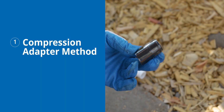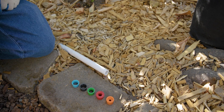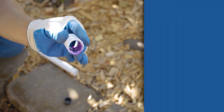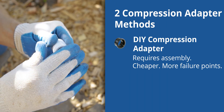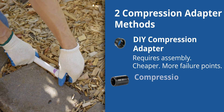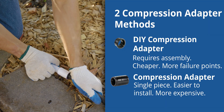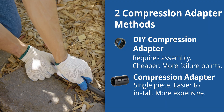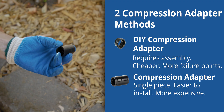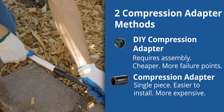This first method is probably the most straightforward and most inexpensive, but it's also the most limited, and there's two ways to do it. One method is the DIY method — cheaper per unit and offers a wider range of tubing sizes, but requires an extra step of assembly. The other is a bit more expensive per unit, but is a specialized part that is easier to install and works for the most common size of one-half inch tubing. If you're just going to make one connection, the PVC to poly coupling will be your best choice, but anything over one coupling and the DIY choice becomes more cost-effective.